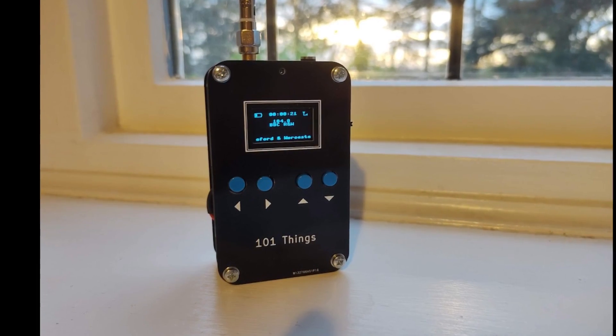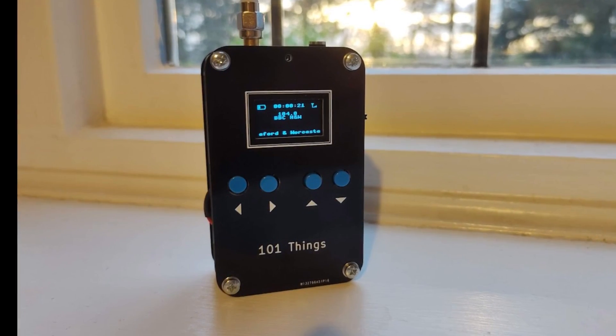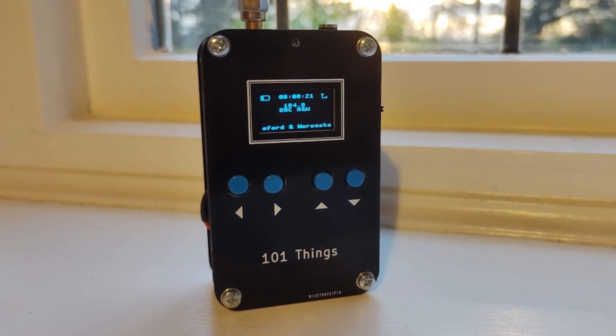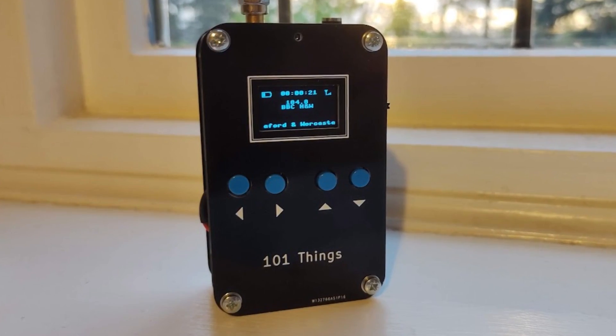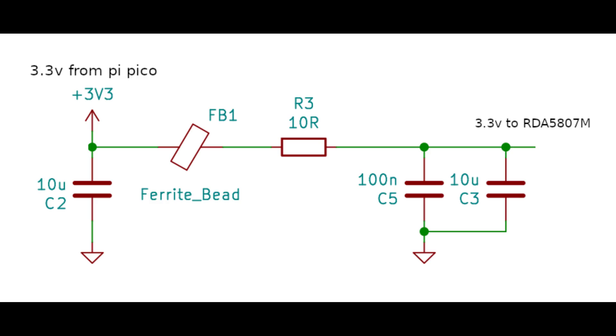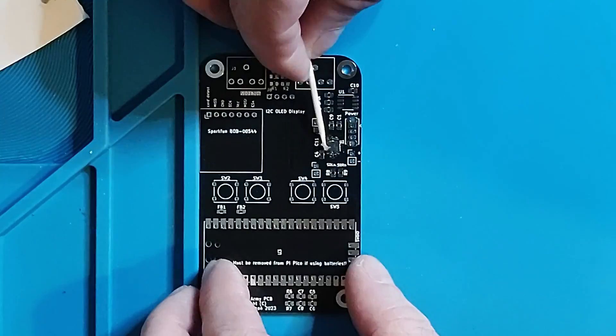Now let's try building a standalone radio. There's lots of room for experimentation here — you could build a retro-style radio or perhaps integrate an FM radio into another project. I'm going to go for a pocket-sized radio that runs on batteries. I'm going to modify some PCBs that I use in other projects to add a small OLED display and some buttons to the Pi Pico. I'm also going to add a stereo audio amplifier based on a TPA2012 IC — it's a Class-D amplifier that can output 2 watts per channel, and because it's Class-D it's also very efficient, which is great for portable applications. I also found a way to filter the 3.3 volt output from the Pico so that it was clean enough to power the radio module. If you'd like to see more details about the design, including the schematics and the parts list, there's a link in the description.